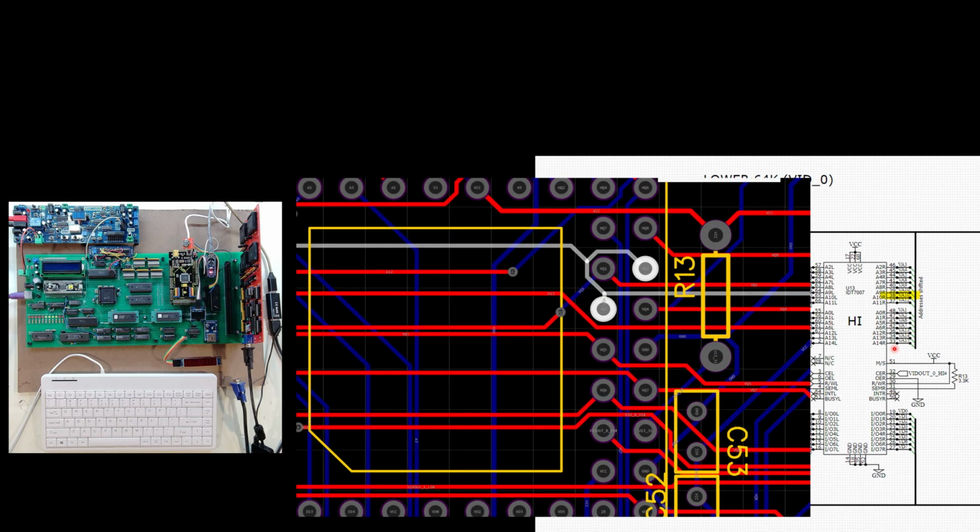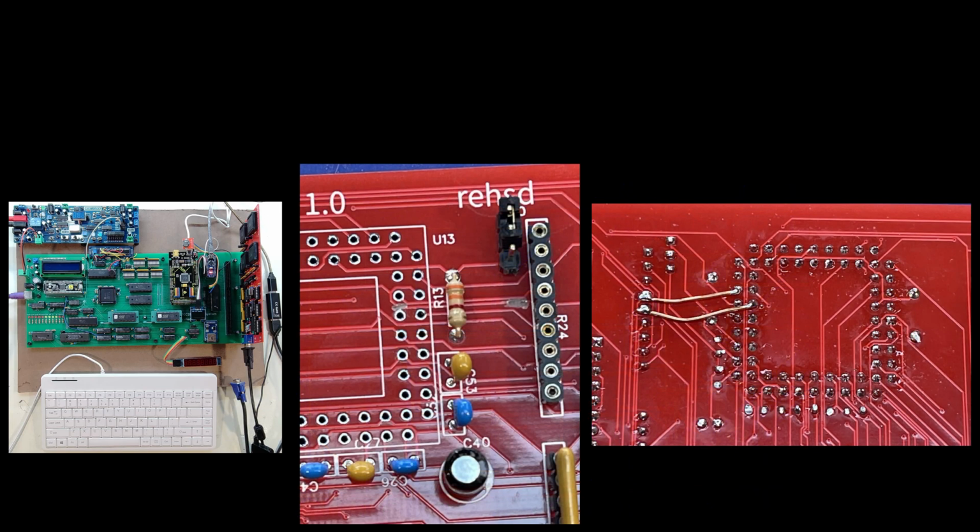So then I had to go figure out how am I going to fix that. This is just zoomed into the specific IC that has the issue, and what you're seeing here is the PLCC socket. Unfortunately, the traces I need to get to are underneath the socket. So what I had to do is desolder and pull out that socket, and then I cut the trace coming into this. This is the error right here. This should be VQ3 is what it should say. So I had to cut this trace and also disconnect it from this other, what's properly set up as VQ2. So VQ1, 2, 3, 4, 5 is what it should be showing, because these VAs connect to the VQs further up in my diagram. So I pulled the socket, and I did some trace cutting.